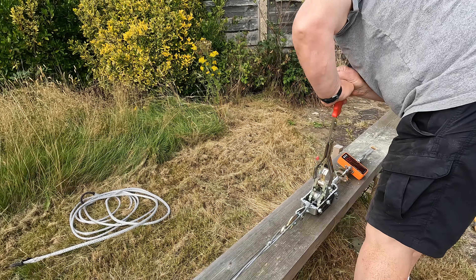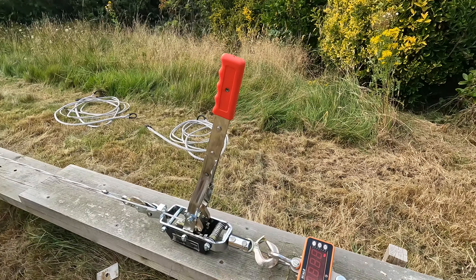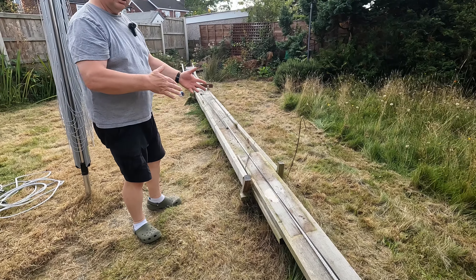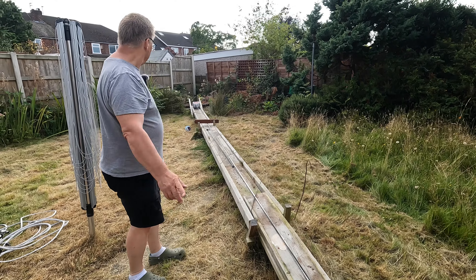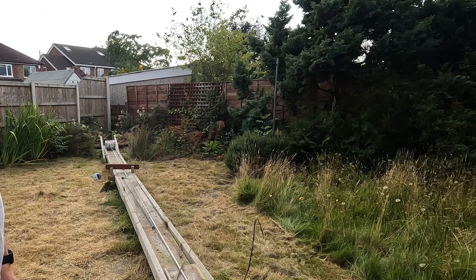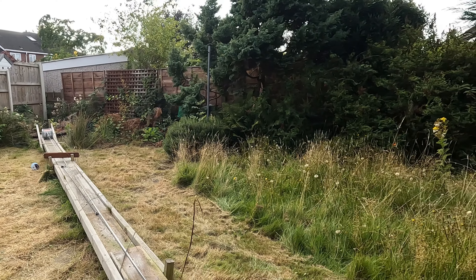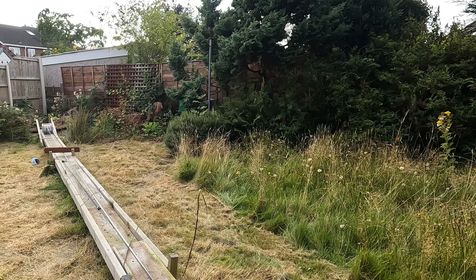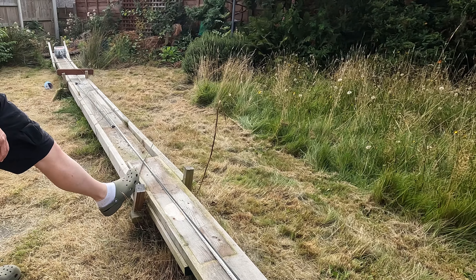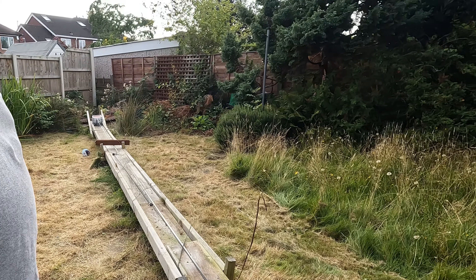The scale's just gone off - one click and it's now reading 650, so we're only getting about a doubling of the pull, which is ridiculous for how many to's and fro's we've got. Dave finds this very frustrating - providing it reaches the amount we need it's working. We tested it before to quite a lot higher and the wooden structure was on its limit. The number two timber should have been the sides and the number four timber the base - that would have given a lot more resistance to bending.